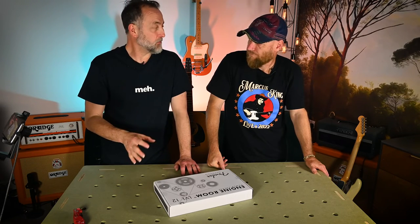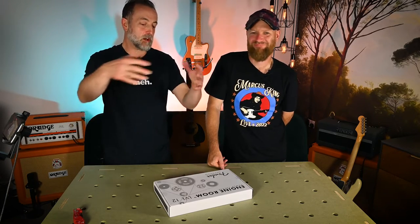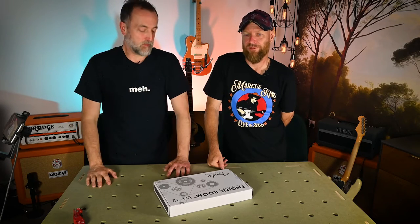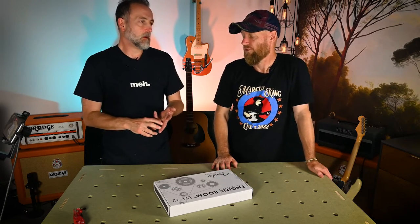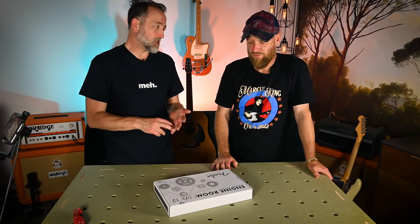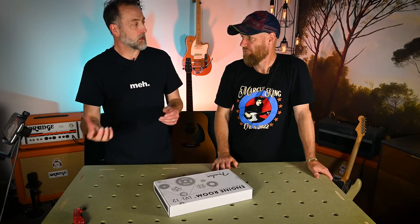With daisy chains, occasionally you will come up against the problem of noise. It depends on the noise on the electrical system in the place you're playing. I've recently come across it with a few pedals where, once you engage certain features, I got noise from one pedal straight away. I believe it's to do with charge building up in the ground cable, and it can flow from pedal to pedal on the daisy chain. I was trying a Walrus Audio pedal and that did not like the daisy chain at all. There was also a Keeley ECOS pedal which didn't like being on a shared power supply.